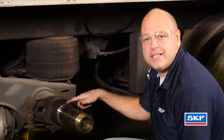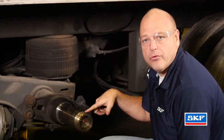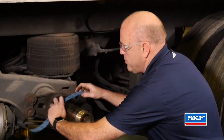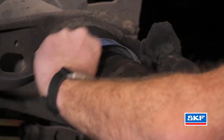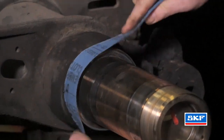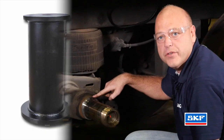After we remove the old wear ring, be sure to clean any sealant off of the shoulder surface. Also inspect the threads and the bearing journals, and clean the shoulder surface with emery cloth if needed. Inspect for any burrs or etching on the seal mating surface.